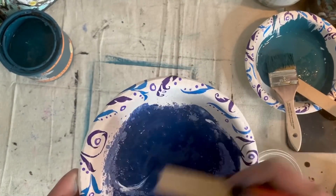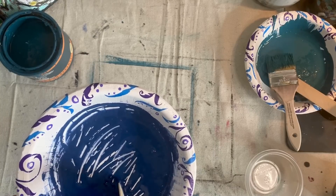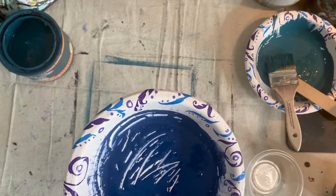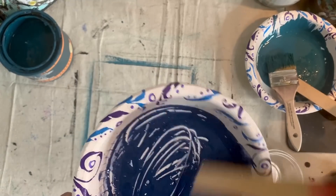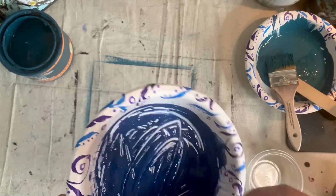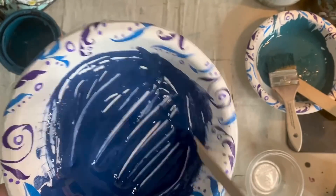We have ocean blue and we also have whale of a tail. The reason why I want to get this mixed up before I put it into my clear glaze is because I don't want any of the milk paint powder to clump up. So this is why it's important — if you want to do the milk paint to tint your glaze, you most definitely can, but if you add the powder directly to the tintable glaze, you could get some clumps. It's like putting flour when you're making gravy. So the best way to do it is to activate your milk paint powder into paint itself, which is what we just did, by adding equal parts Junk Monkey milk paint powder and room temperature water. Now we have a nice smooth paint, which brings us back to the same point we were when we started working with the Seahorse glaze — same idea, same process.